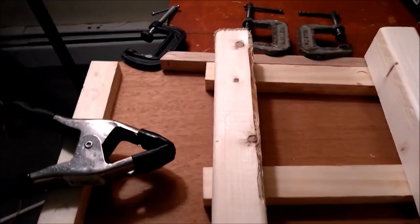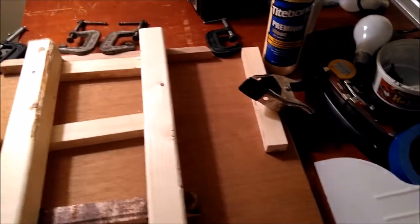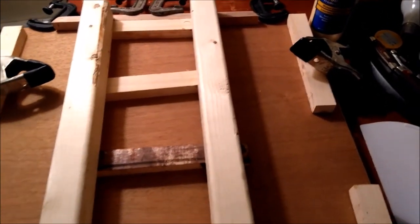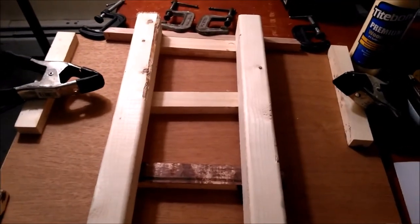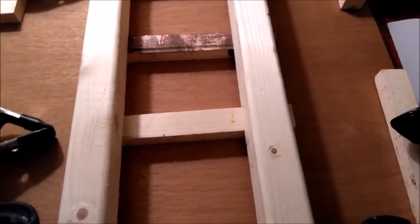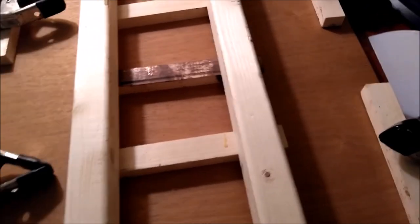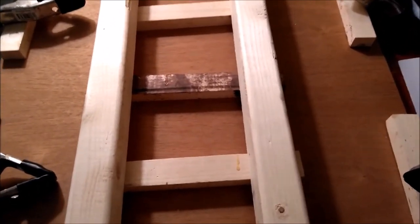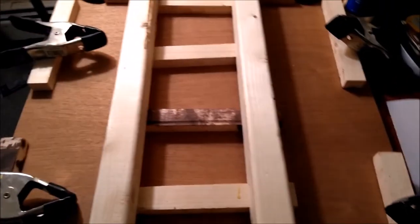And then all along the edges, I'm going to come in here with some of the scissor clamps, as you see there, but also I've got a bunch of regular C clamps that I'm going to be using all along the edges and so forth. It's going to be a big project. I hate doing something this big. One of the problems you have when you're doing a glue down like this is that the top piece, as you're gluing, wants to skate. In other words, it's like you've got this slick of glue between them, and it doesn't want to stay in one place. And so what I'm going to do, I've decided, because this is going to be narrower than it is, okay?